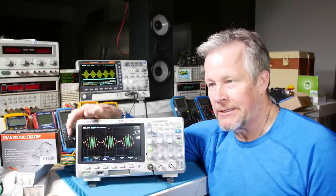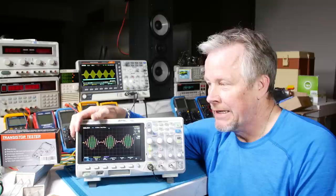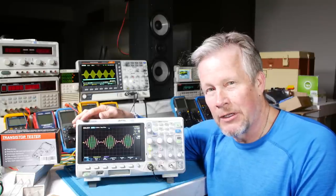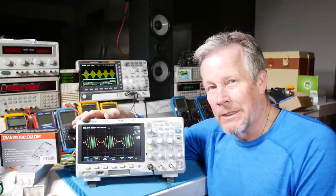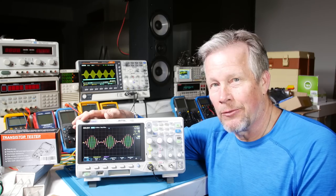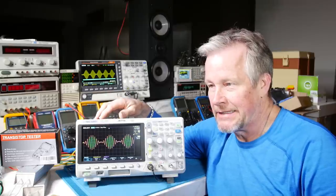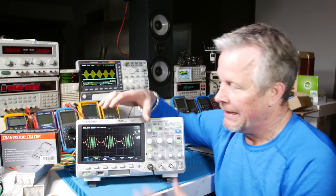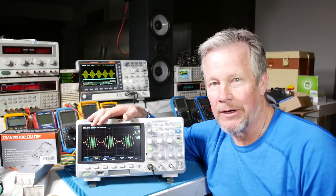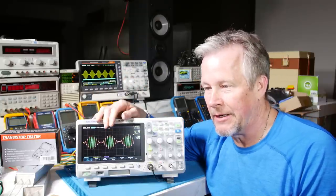Let's give analog scopes a little respect and explain how Tektronix got such a great name. Tektronix really helped develop oscilloscopes back in the day — they may have been right there at the frontier. They were made with CRTs, just like televisions back then — cathode ray tubes, big old long tubes. The scopes were this deep on your bench because of that big tube, and the display was about yay big for a nice one. You had electrons blasting up into the tube hitting the phosphor, brightening it up and giving you your display.